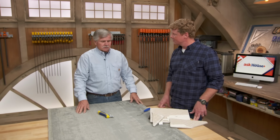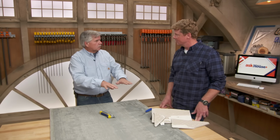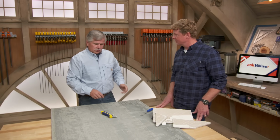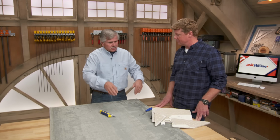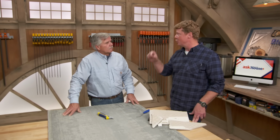It comes in different thicknesses. I would glue this entire system down to the plywood. Thin set trowel down, notch trowel, and screw it probably 8 inches on center. Let it set and then put your tile on top of that. For a patch, in this case, that doesn't make sense, and certainly that would give you too much thickness.